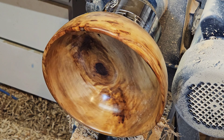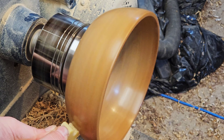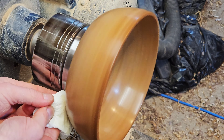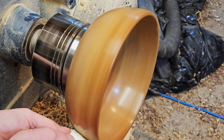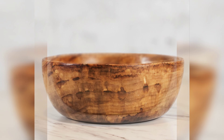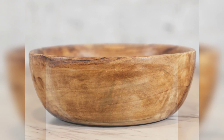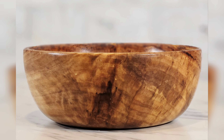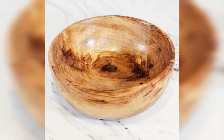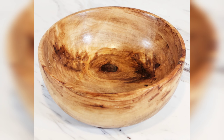I'm doing the inside the same way — lots of layers of shellac, lots of friction, lots of heat. I even burned my fingers once a little bit, but not that bad. Part three of my finishing process is wax — beeswax, to be specific — going on top of the shellac. It'll give it just a bit of extra protection and will also deepen the shine.